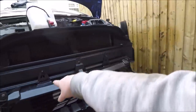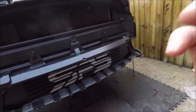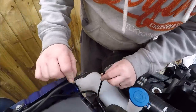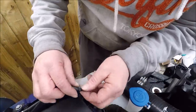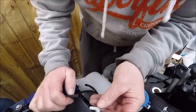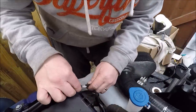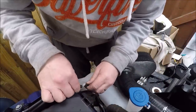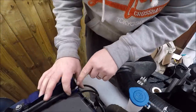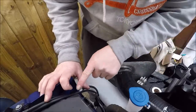I'm going to set up some pipe work now before we drill some holes and stick the jets in. The first thing I want to do is — there's a join in the pipe here. Find the pipe that goes to the rear window; there's a straight joiner. We're going to swap that out for a T-piece. I'll put some cable ties around that and tighten it up, so that goes back there. Then we're going to T off to the intercooler spray from there.